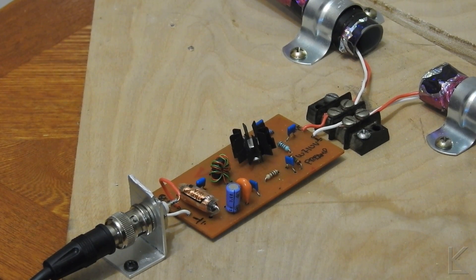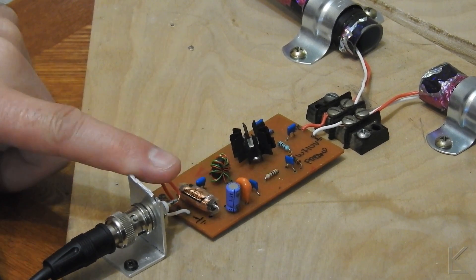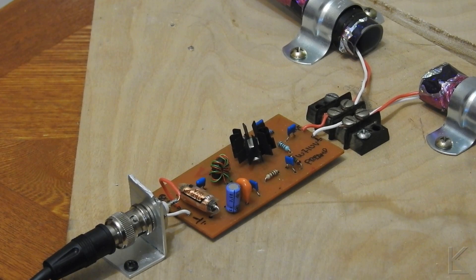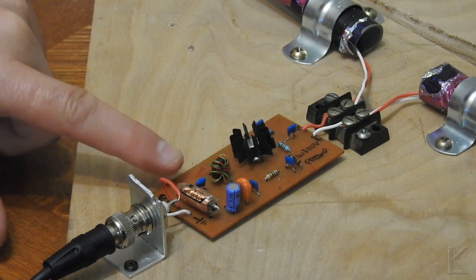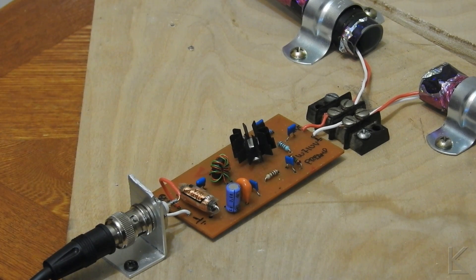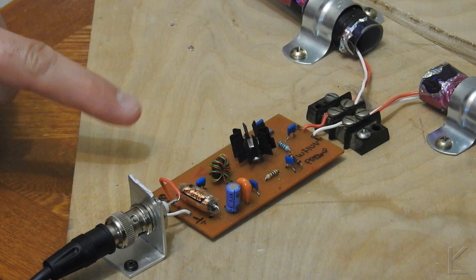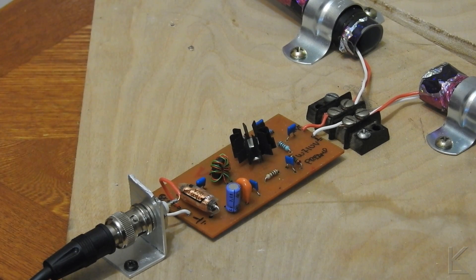Really simple — not much at all to putting this together if you have the preamp board. You could go without the preamp and hook the antenna directly to the receiver and it would still work pretty well as a receive antenna, but the preamp really makes it hot — incredibly sensitive in fact. If you're really close to any broadcast antennas you probably wouldn't have much luck with this, but if you're out in the country, this would be a really great hot receive antenna.